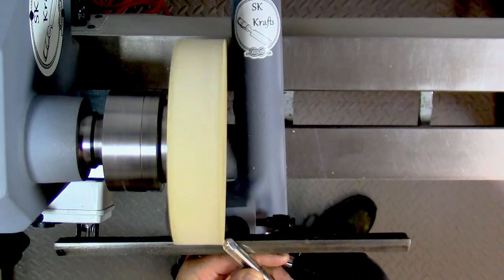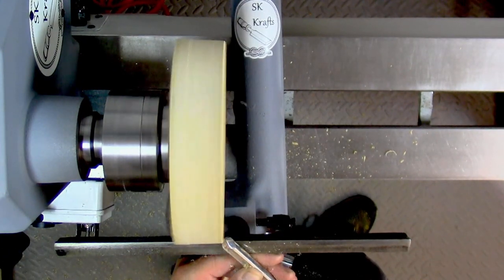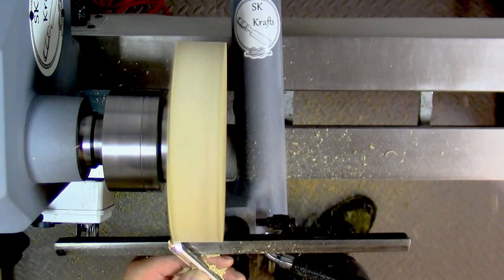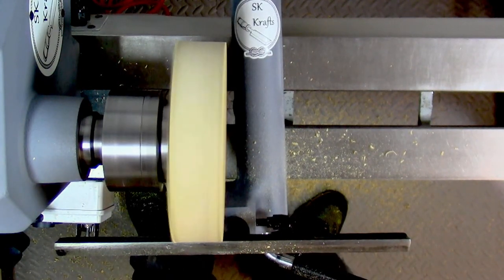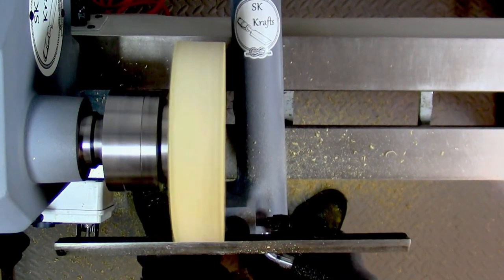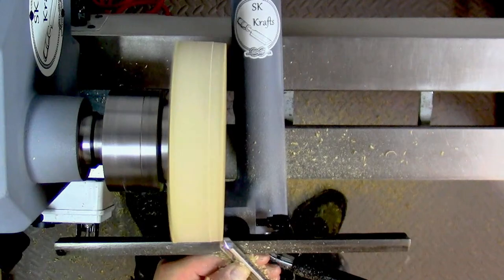We're going to do it again. So A, B, C: anchor, bevel, cut, and then feed the tool. Now all the movement going from side to side is all in the body weight. It's moving your body weight from side to side. You're not pushing your arms across, you're moving your whole body across. So you're standing where you want the cut to finish, and you're going to be uncomfortable to start your cut, but when you finish, you should be comfortable. So again, anchor, bevel, cut, and you can see my whole body is rocking over.